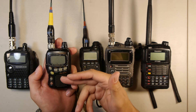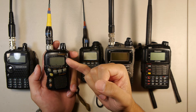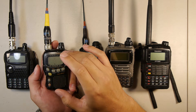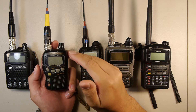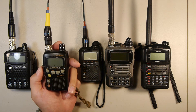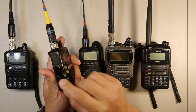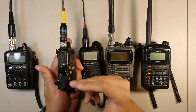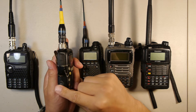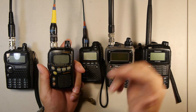It's not the most impressive in terms of transceiving capabilities but given its size it's fairly decent. It offers decent wideband reception covering AM broadcast stations from around 500 kHz to 1800 kHz, then 76 MHz to 108 MHz on FM broadcast stations, and up to 999 MHz minus the cellular band. One thing I really like is that I have a DC-to-USB cable converter for this radio and I can run it directly off USB power without too much RF getting into the radio — very valuable in a monitoring situation outdoors on a mountain or in an emergency.